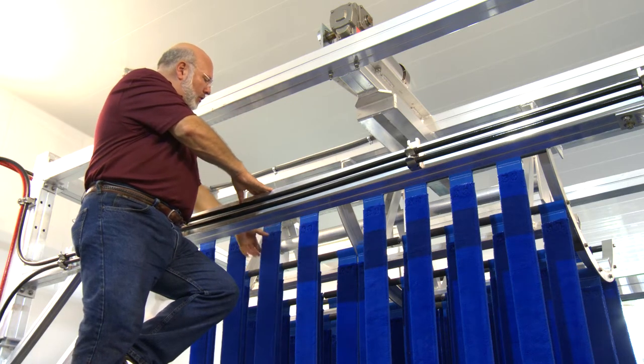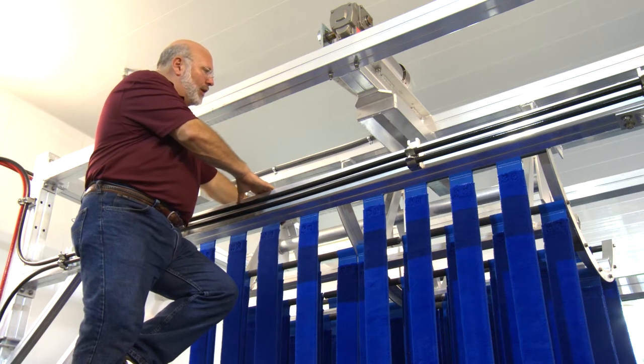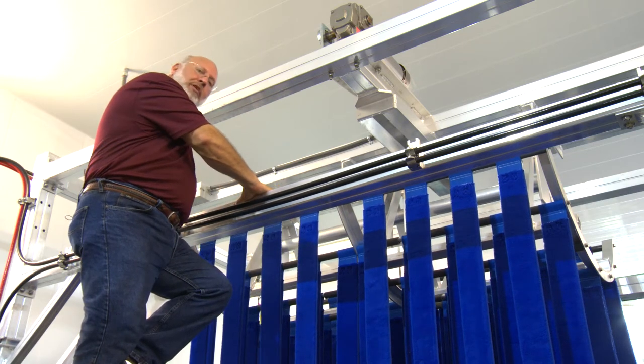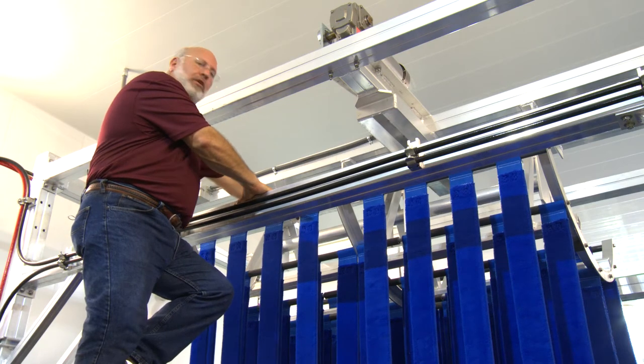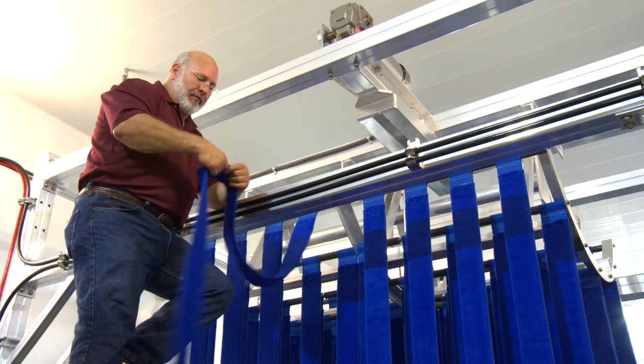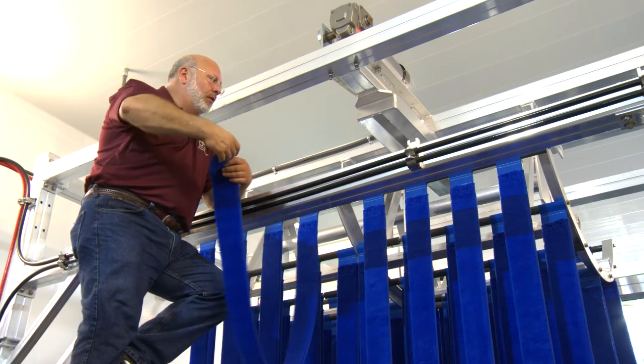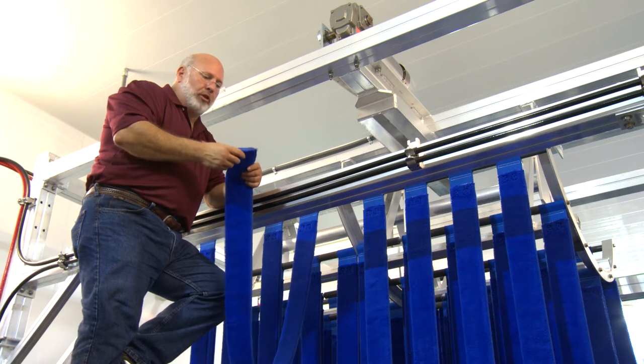We're able to run this mitter with either cloth, micro clean, or echo fi. The cloth rods are real easy to use — 9/16 wrench on the ends, undo the bolt, lower the rod, change the cloth. You've got to inspect your cloth on a regular basis. You may sometimes need to clean it due to mildew, or some buildup from soaps, detergents, or chemistry.